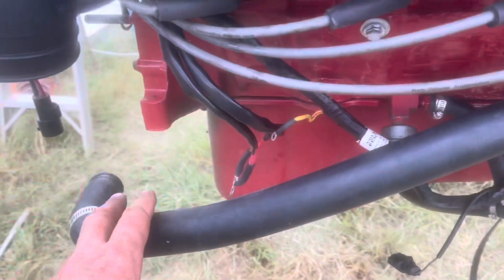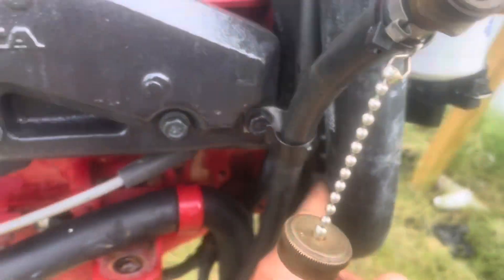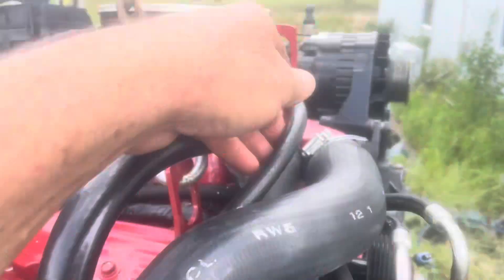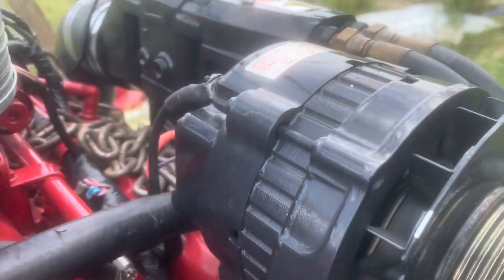The coolant inlet hose to the pump comes along here, it's in this bracket which I'm about to remove, and goes to the pump. Coming off the pump, this hose comes back up behind here — this is a coolant hose, it's cool water for your fuel cooler. That tank is a fuel cooler; this entire unit is a fuel cooler. This hose here feeds it, and then one of these hoses comes across and goes to the exhaust right there — that's where the water is dumped back out through the exhaust from the fuel cooler.